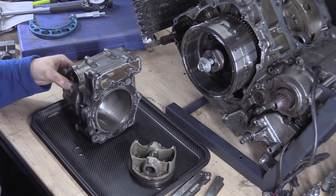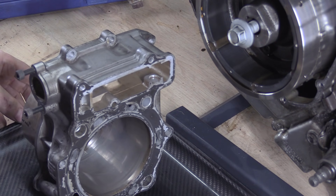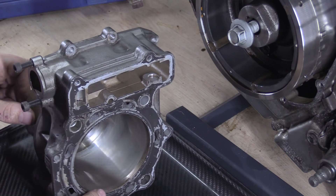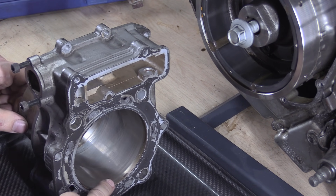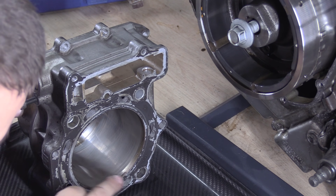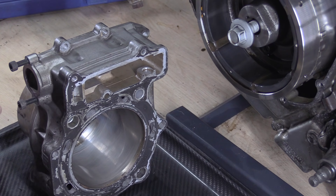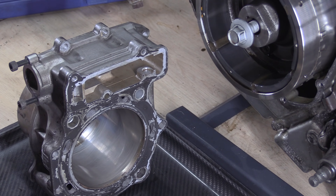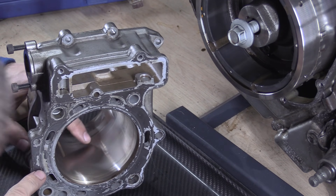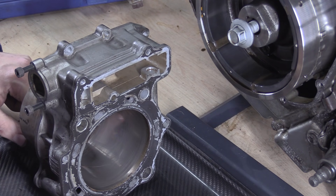You'll see there's an area here which is the dead space in the cylinder — this is where the piston rings don't go any further up at TDC. Sometimes you'll see two bands, and that's usually when you rev the living hell out of it and the rods are stretching, or under general high load at low running speeds. You'll also see there's some dead space at the bottom below a certain region because the piston doesn't go any further than that.